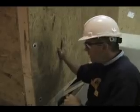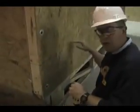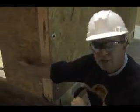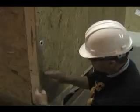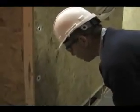The wall has a 14-inch chase, 14 inches above finished floor right here, running horizontally. This wall, however, doesn't. In some cases, if we need to turn the corner and we can't do it in the floor system, we can merely take the ship auger bit and crisscross holes to allow this horizontal chase access through this lumber, and then drill again the other direction, pull the two together, and then foam it back up when we're done.